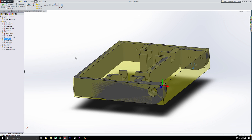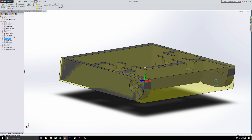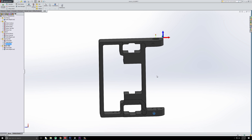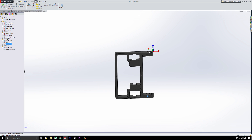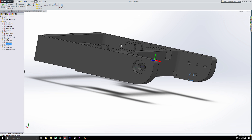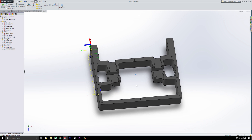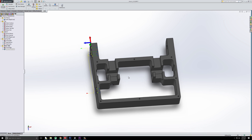Then we have the bearing side — that's just the front edge profile, the recess for the bearing shaft, and the hole for the shaft. I'm using an end mill for pretty much all these operations because I don't really want to switch back and forth to a drill bit, and also this part sits so high in the machine that I don't have enough clearance for a long drill bit. On the motor side, there are just a few drill hits for mounting the power switch and the motor, plus the contour on the front leading edge. This material is very flexible, so you always need to hold it down — there's a lot of interesting fixturing going on.